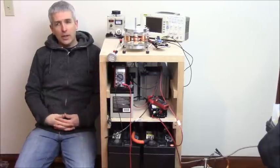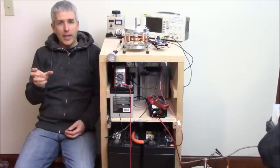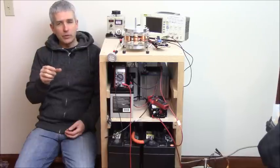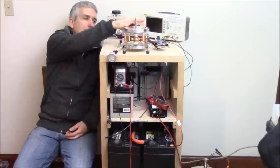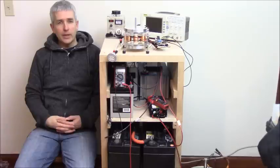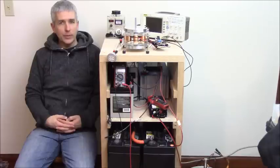And that will change or shorten the on time. So even though you have a big magnet passing a relatively big core, you can control the on time, in which the Hall sensor here on the top is positioned just really, depending on the voltage you're running it at, just before top dead center or after top dead center of the magnet. And so at startup, though, at the higher voltages, you have to really retard the timing, and then as it gets up to speed, you'll have to change that.